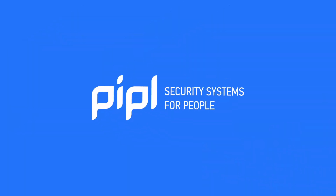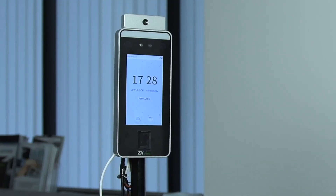First things first: we install this terminal on our entrance turnstile and connect them to each other. This is applicable to all doors and entrance areas, like we did for our door with the electromagnetic lock. Then, via the manufacturer software named ZK Bio Access, we uploaded a database with up to 6,000 faces of our employees, up to 3,000 hand palms, and up to 6,000 fingerprints — though we won't be touching fingerprints this time.